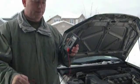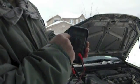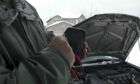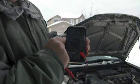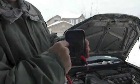So what you want to do is set up for DC voltage. This is DC voltage here, and this is AC voltage with the waveform. DC is a straight line with some dots. Your battery is about 12 volts DC, so we're going to put it in the 20 volt range.